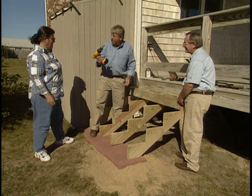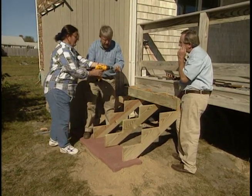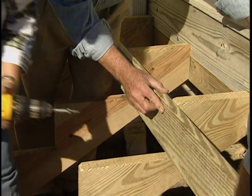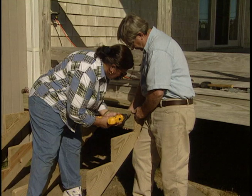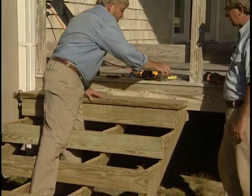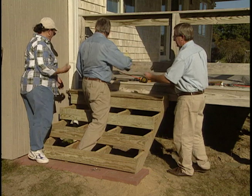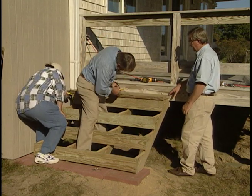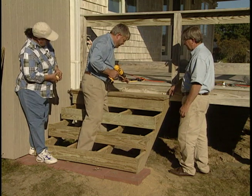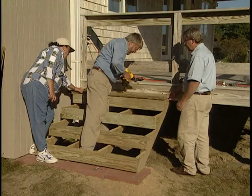Suzanne, why don't you drive some? This is a special square head driver with stainless steel screws — these don't strip out as easily as the Phillips, so give these a try. Now it's time for the treads. This is the stair tread — the one we walk on. It's a 2x12 pressure treated. I want to make sure that the overhang is the same on both sides — it should be about a half inch. I'll draw a small line right down the center of the stringer, and then we'll attach this with some more of these stainless steel screws.